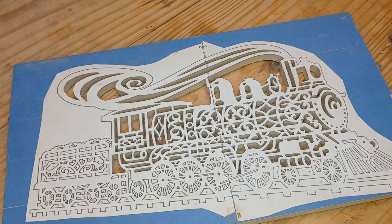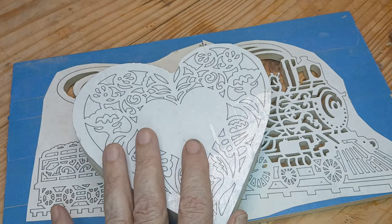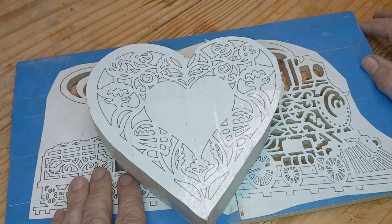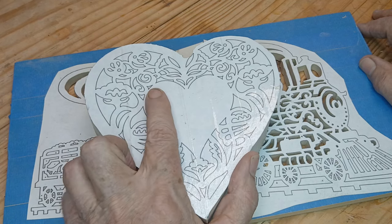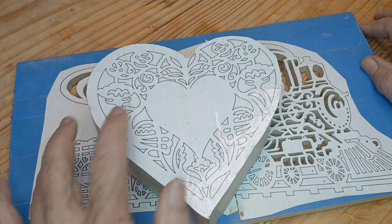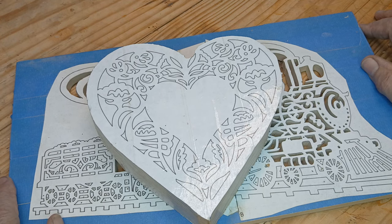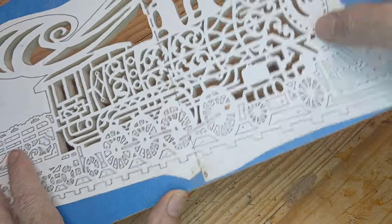That's the problem you get into if you try to use too small a blade in too thick and too dense a wood. I don't generally cut wood this thick — three quarter inch is generally as thick as I get, although I'll go to two inches sometimes on a compound cut. You generally don't have an intricate cut like these at that thickness, but if you do, you don't have much option. You could cut that with a 5 and it wouldn't be impossible, but it's much easier to cut with a 3. So to me, that's the first criteria — the size of the cut — because you can't use a 5 or a larger blade in cuts like this.